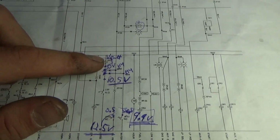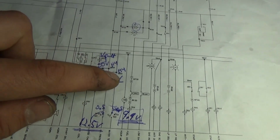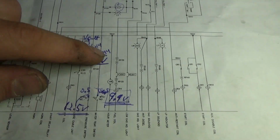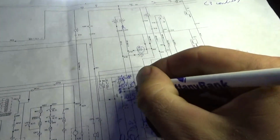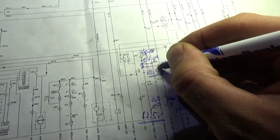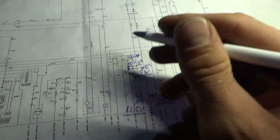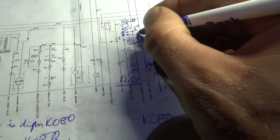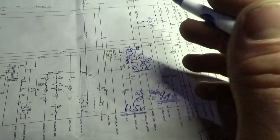and that's why the tractor is shutting off. What we want to do is, at this junction, just remove this part. It's basically the same thing as cutting this wire right here. Boom. So everything will work, oil pressure, that will work. The only thing that won't work is if the thing gets too high, it won't shut itself off.